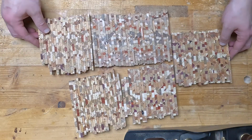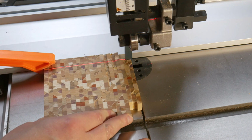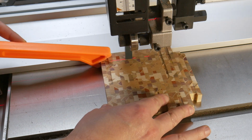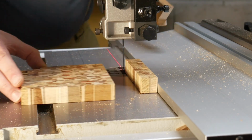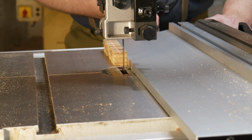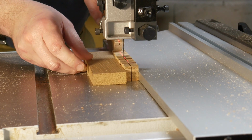Now the pen blanks. I've tried 5 different layouts, if I remember correctly. First, I just cut a 20 mm square pen blank from one of the boards. Second, cut it in 2 halves, turn one half around, and glue them together. Third, I cut 2 halves from 2 different boards. Number 4 and 5 are the same as number 1 and 2, but the blanks were cut at 30 degrees.